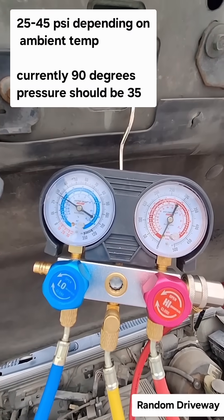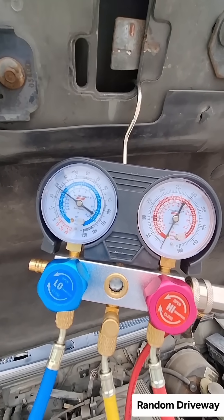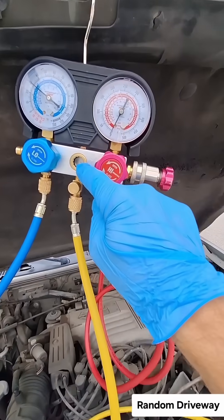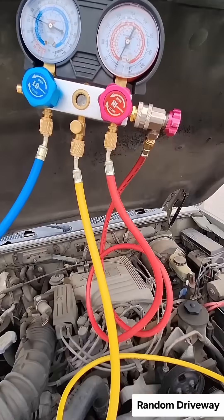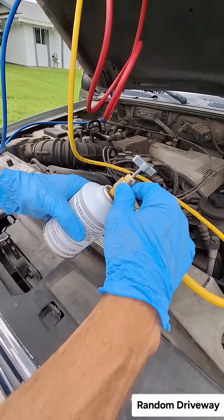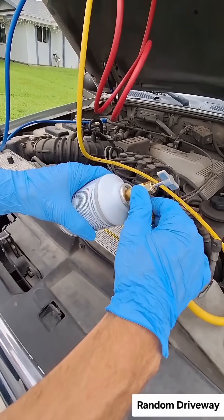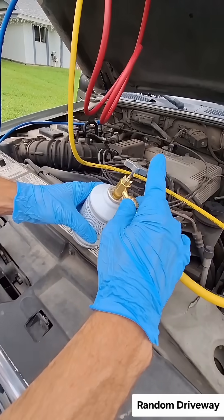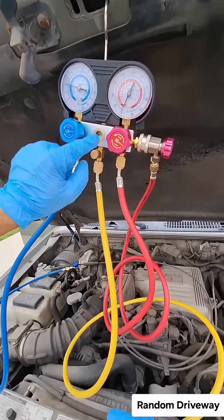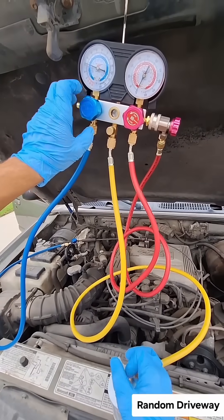When it cycles down and we're dropping a little lower, so we're gonna add one more can. You're gonna see the refrigerant go through this sight glass — don't over tighten, just snug it down, maybe two pounds to snug it down. Turn this to tighten it; that's going to open this can and let in refrigerant.